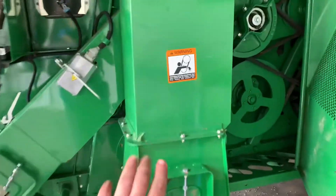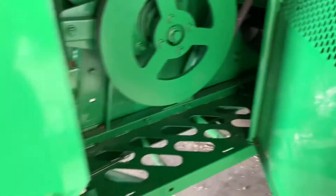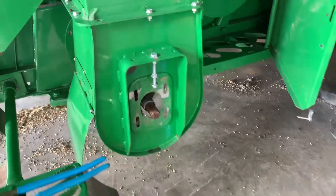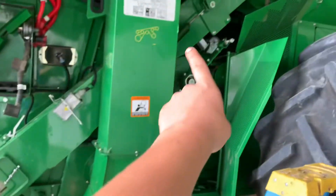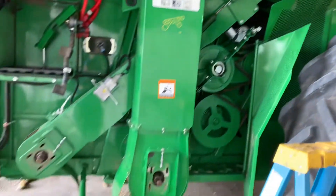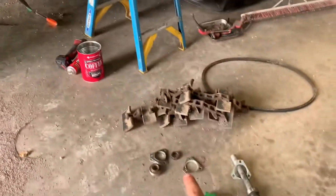This is the clean grain elevator, and that chain is good, so we're not going to replace the chain. We're going to just put a new bearing on, because that one's good. But this one was really worn. So we got all the parts — now we get to put it back together.